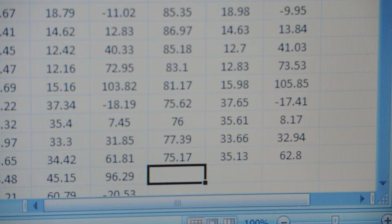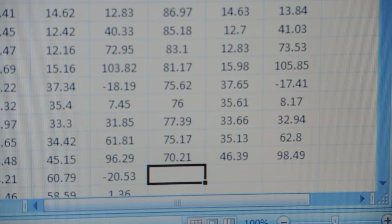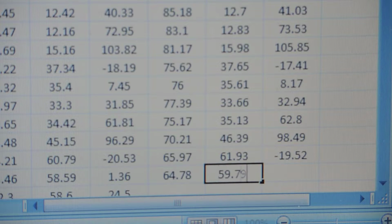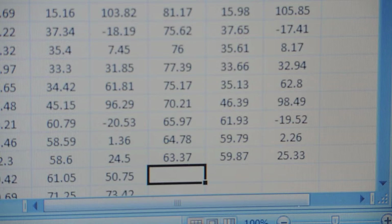This chart has been sitting in contact with oxygen on my desk for a whole week. So the question could be, are these valid still? Is it still valid to make comparison to colors that were measured a week ago? And if I want to be really picky, what would I do? I would remeasure the chart with the DTP41 freshly. Then I know I would be comparing fresh numbers with fresh numbers from the two instruments.